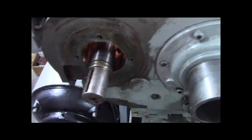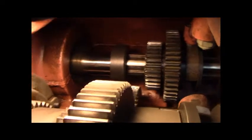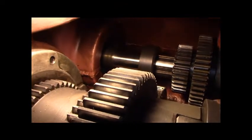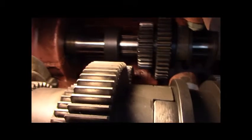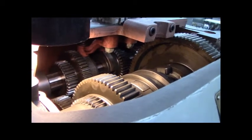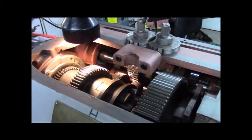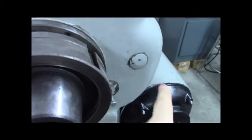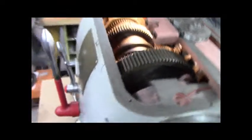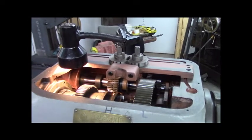Let me show you around the headstock side. That's the input shaft, and the spline, and the gears, and all the works. So that's the primary input, and it's supported on the other side with a bronze bushing as well. There's the primary shaft, there's the secondary shaft where the bolt is, and the main spindle. The shifter levers are on top where the lamp is clipped on.